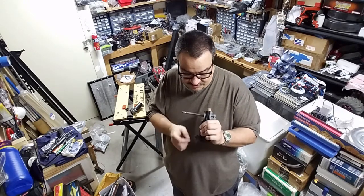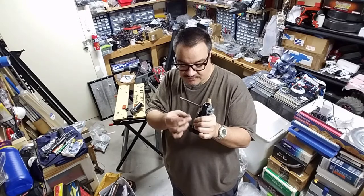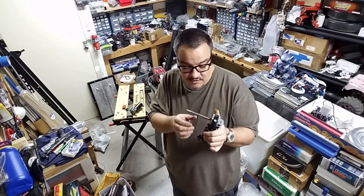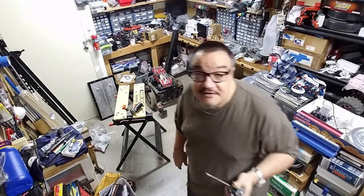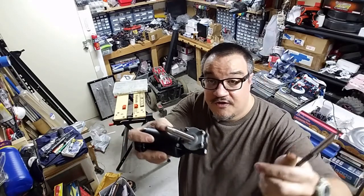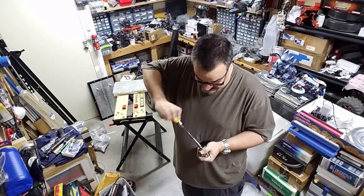Because the terminals are so close together, it's a little tight, so if you rotate them just slightly at an angle you can get the connectors on very easily. You could cut the shroud off for more room, but I want to keep it because I'm going to fill the area with hot glue or silicone for weather protection outdoors. The screws holding this cover and shaft in place are Torx T25 bits — a fairly common size. All we have to do is remove the screws.